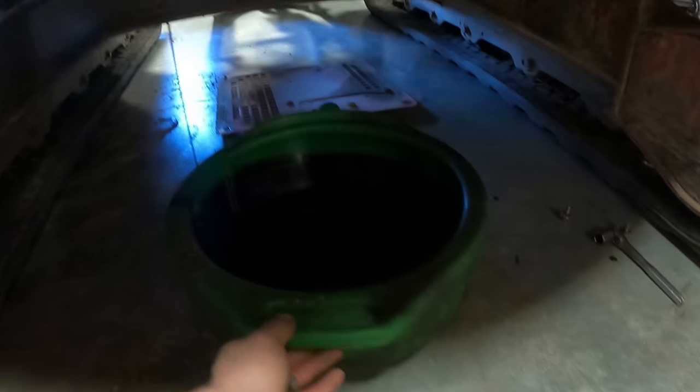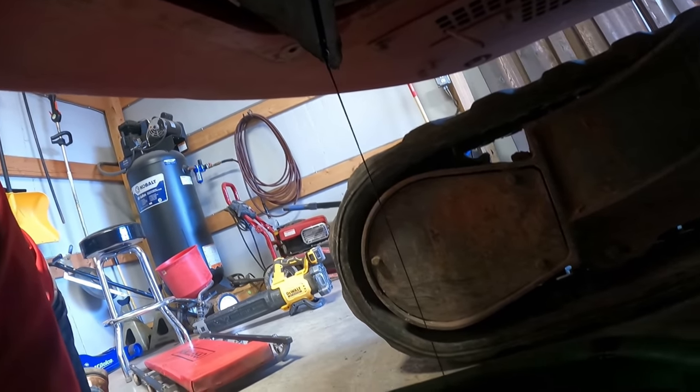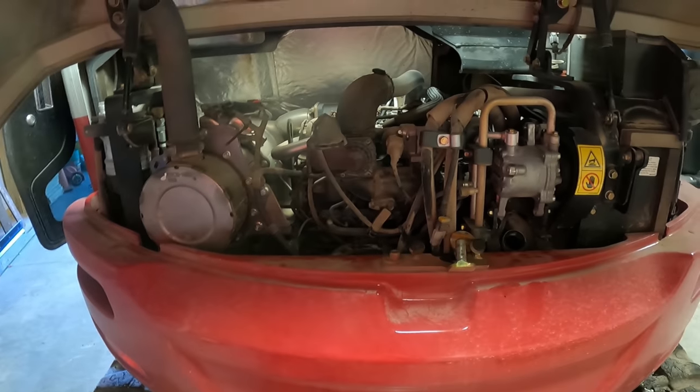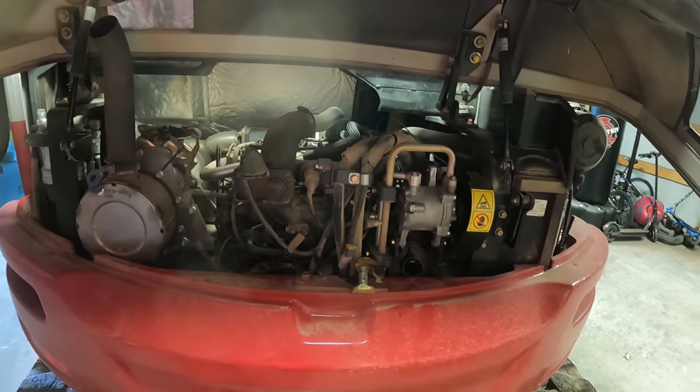Yeah, you can't really see, but now I'm taking the oil filter off, and I got my little cardboard thing, which looks to be working. I just put a piece of cardboard in there where it keeps it off those hoses and stuff, and there's a little less to clean up. Like I said, you can't see, so we'll get this switched, and then we just got the hydraulic, the water separator, and the pilot line, and then we'll fill it up with oil and start it up.